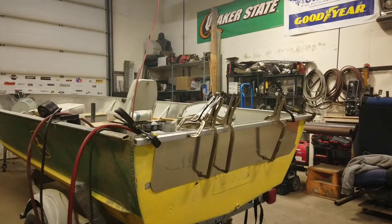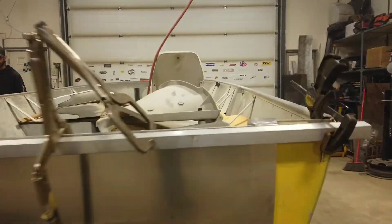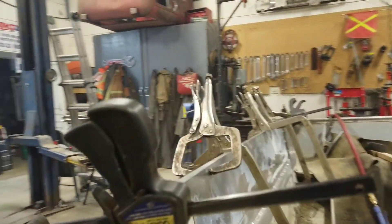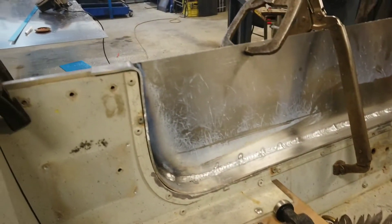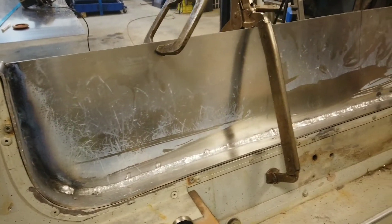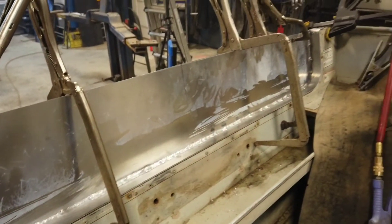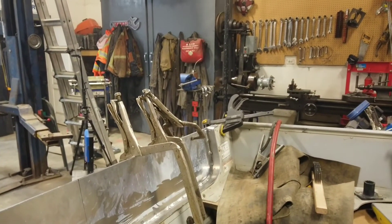Here's where we're at. Got the plate on the back — that's done, that's basically where it's gonna live. It warped a little bit when I put this weld in here. Even though I stop-and-started and staggered all over the place, it still warped a little bit. But it is what it is, I guess.